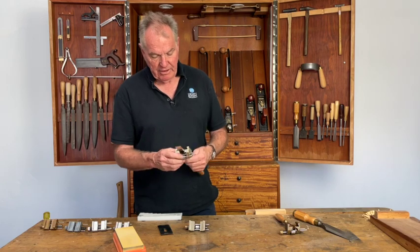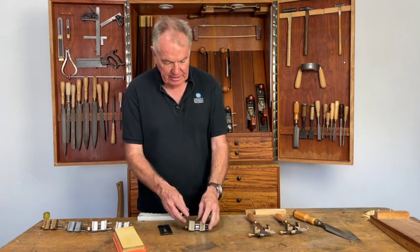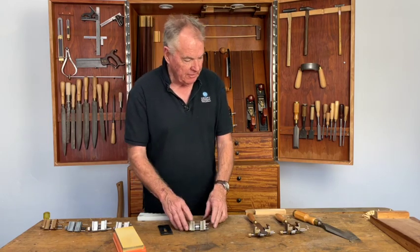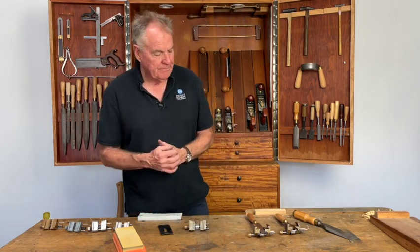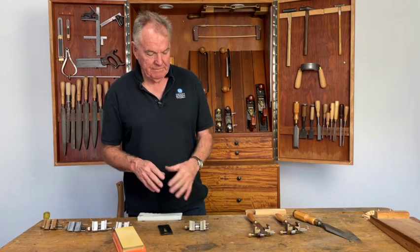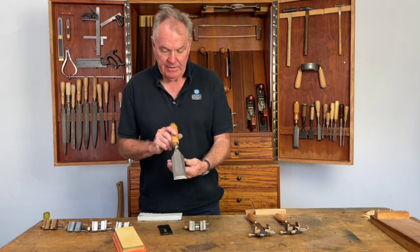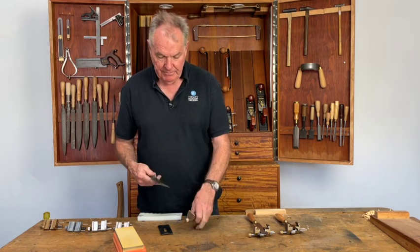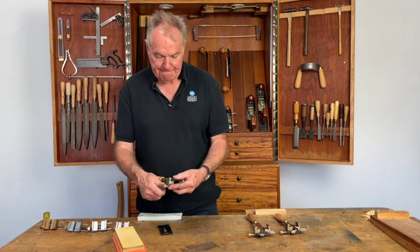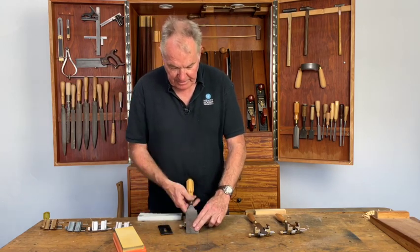The chisel jaws in between range from 8mm to 45mm. All of those different jaws overlap each other, so there's no reason why you can't fit any bench chisel or plane blade in these jaws. If you've got a very wide chisel — like this two-inch chisel here — that can easily be held in the plane blade jaws on top. Away you go, no problem.